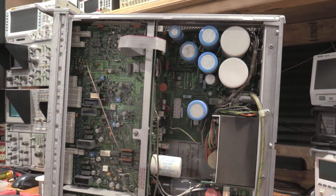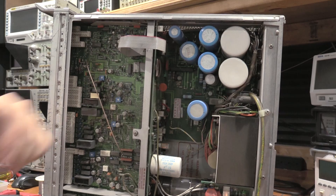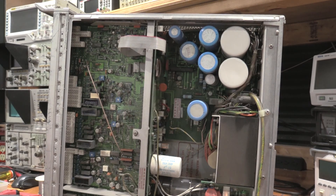The second step, after adjusting the power supply, if you have to adjust any of the timing, does require a full calibration and alignment on this unit. So we're going to check the power supply. If the power supply is good, we're going to call it there. If not, I'm going to have to bring in the cal equipment and do a full alignment. If I have to adjust the power supply, it's going to require a full alignment to get it back into specification. But let's see how this power supply is doing.